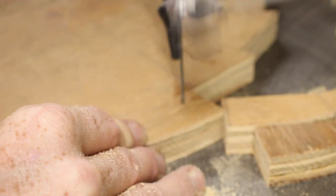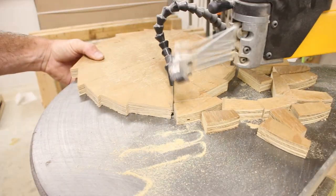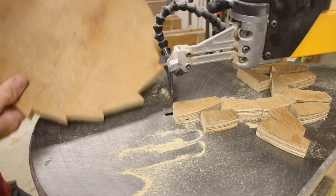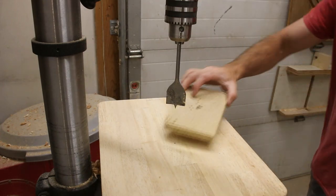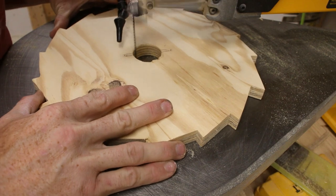At this point, I wasn't really sure how much the head was going to lift with one full crank, and so I didn't really do any math to make sure that this was going to cut in any kind of specific measurement. When you're working with a sawmill, it's a good idea to know exactly how high you've lifted every single time, and so people will have all kinds of things from DROs to computer lift mechanisms.